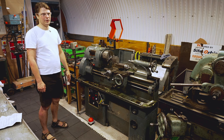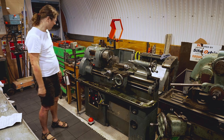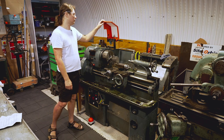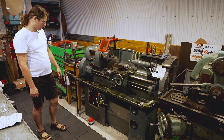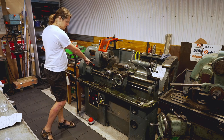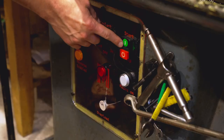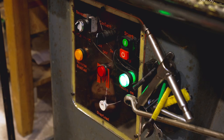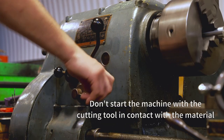In order for the machine to be started, you should be signed into the tool control and the machine should be powered on. Then you have to make sure that the guard is closed, your e-stop is undone, and your start lever is in the first position. Then you can turn the machine on, press the start button and the light should turn on. The green-red light indicates that the machine is on but not operated. Then you can start the machine and it will start spinning.